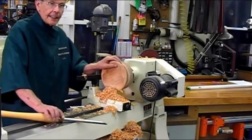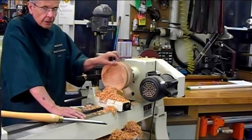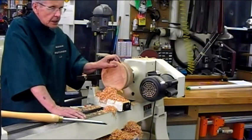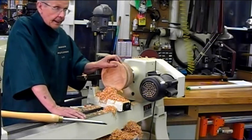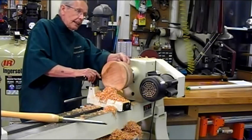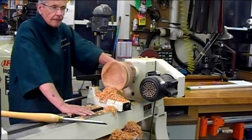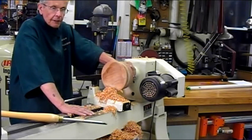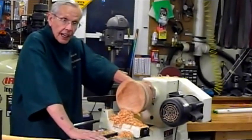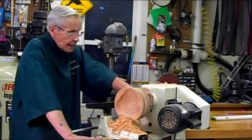I'm not going to bore the ears off everybody turning the back off this thing. We've all done what we're seeing done. Right now, I'm starting right in here with a relatively uniform thickness, following down with that inside slope. And from there on, to finish the back, we can cut right deep in here because we've got plenty of clearance for that chuck. It doesn't leave you a great deal to clean up. Turn it around, reverse chuck it with a jumbo or cole jaws. Use a vacuum chuck. Use a jam chuck. Whatever suits you, or whatever you happen to have. Clean it up.